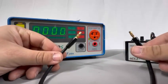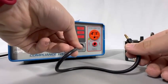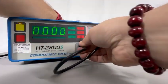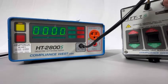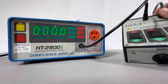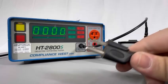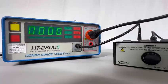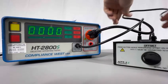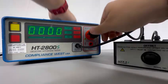We're going to use this banana cable, which we are going to connect to the return connector of the high pot tester, as I'm doing right now. The other end we're going to connect to the return connector of the HTT1S, as you can see right now. We also have a NEMA male connector for the HTT1, which I'm going to use on the high pot tester's NEMA connector.